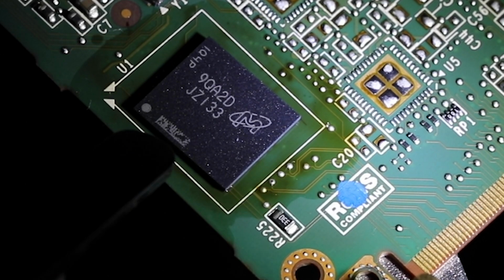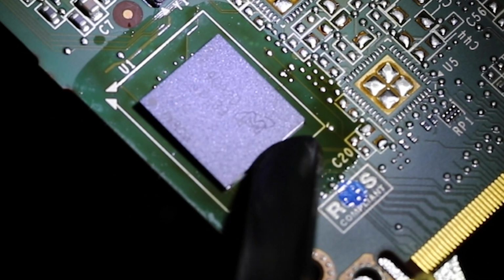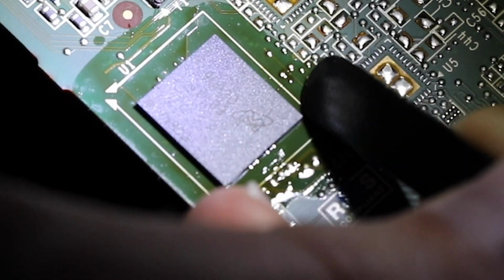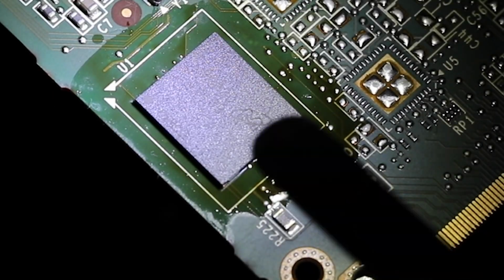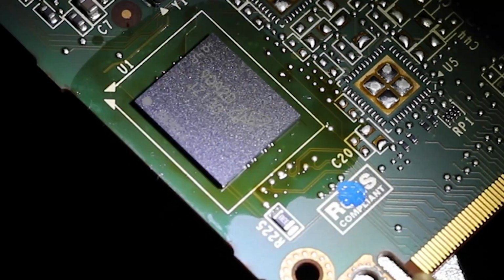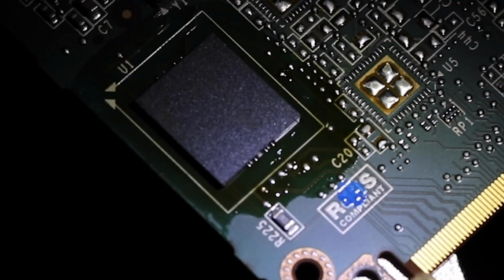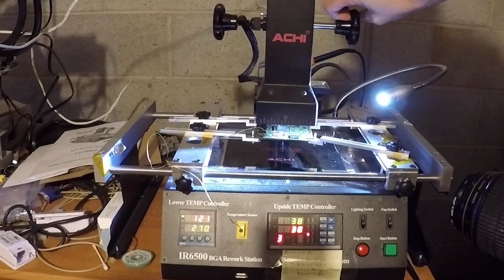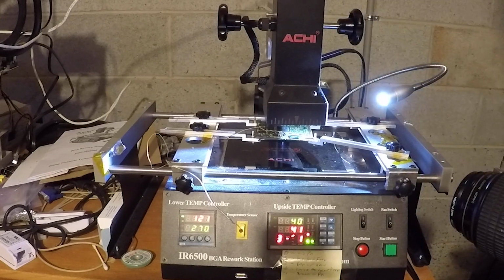We will carefully move the chip around to ensure that it's between the edges you put in before on the top and bottom, and between two rows of the contacts on the right and left. Turn the heat on to solder the chip back in place.